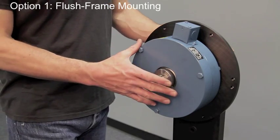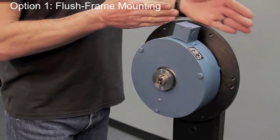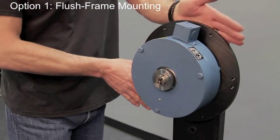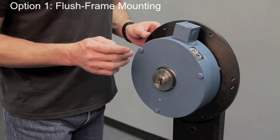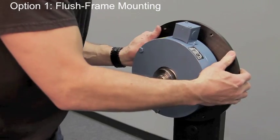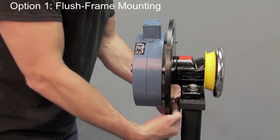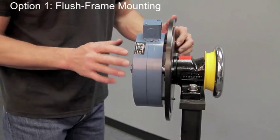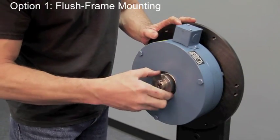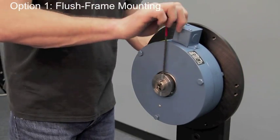This is the mag power global brake and it's currently mounted. We have a plate here representing a customer structure — a wall or anything like a plate. We are going to use these screws that stick through the back; they will penetrate through the wall structure. We are not going to put any nuts on the back. Everything will be held on by the collar set screws. We are going to remove those first to take the brake off so I can show you how they go through.